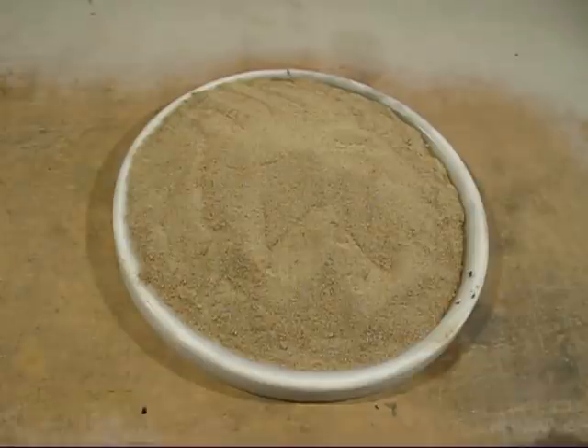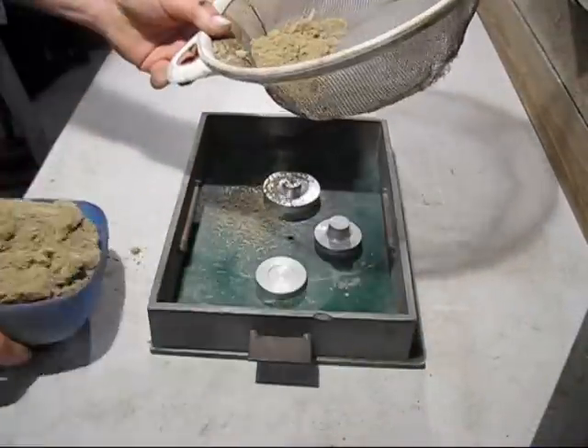I was going to make only one mold with sawdust sand, and there's a very good reason for it: I'm going to make exactly the same casting with coal dust sand in the same melt, and you'll be able to compare the surface finish and see how they look, and also how they machine.